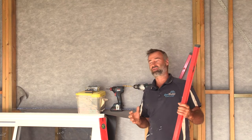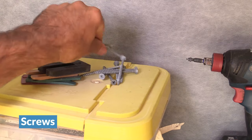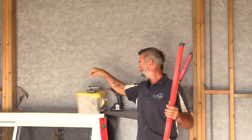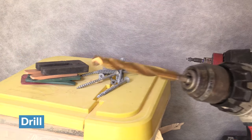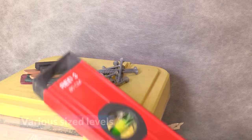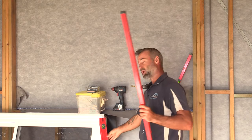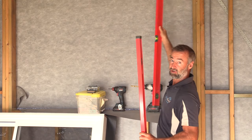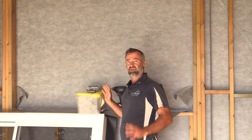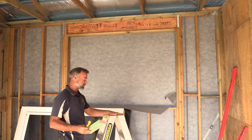For tools you're going to need some plastic packers in various sizes from about one mil up to ten mil, some screws for the sides of the timber reveals to put this into the stud work — anywhere from 100 mil to 75 mil, I generally use the 75 mil eight gauge screw. You'll need a drill with a bit large enough to countersink the screw heads, a battery drill for screwing, various size levels — one long enough to go across the base of the sill and one long enough to go up the style. You'll also need a Stanley knife to cut the wall sarking and a timber block, and probably a ladder to stand on.